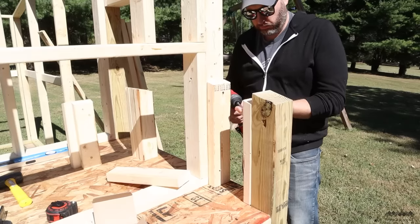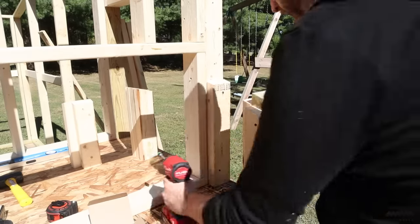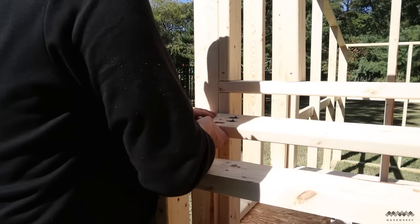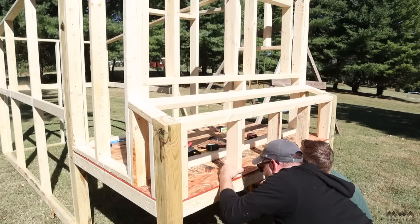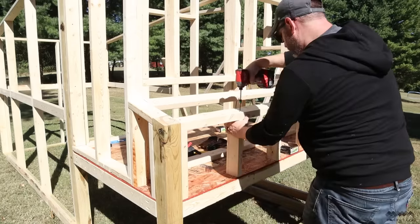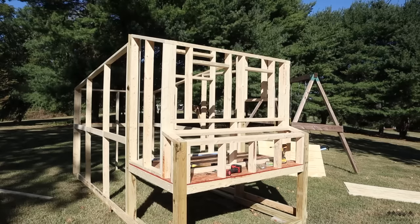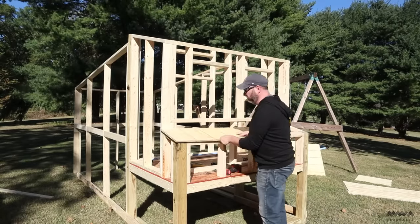The last bit of framing is the nesting box. I reserved the last 12 inches of the coop just for this. The ideal nesting space is 12 to 14 inches wide, which gives me room for four good-sized spaces — plenty for six birds. I'm told the birds will end up picking just a couple of favorites and always use those.